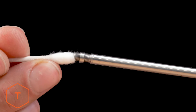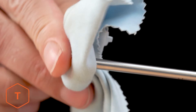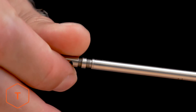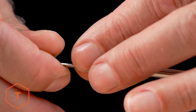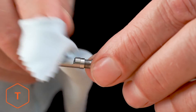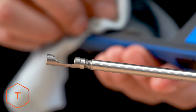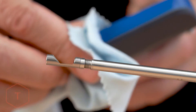To get the best image quality from your borescope, clean the camera lens and mirrors before and after each use with a soft microfiber cloth and a cotton swab. For stubborn stains, you can use warm water or rubbing alcohol, but don't use stronger solvents. The screen and monitor case can also be wiped down to clean away dust and fingerprints with a microfiber cloth and a few drops of warm water or rubbing alcohol.